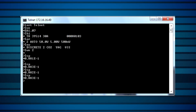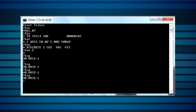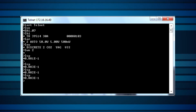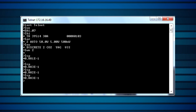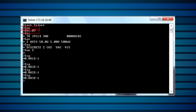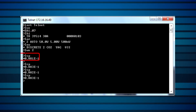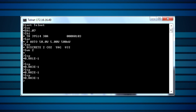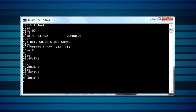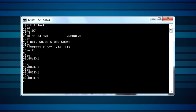Using the Telnet connection on a PC, it'll look something like this. Here you can see some manually sent commands and the responses — for example, a query about the current firmware version and the response, or a command to send the latest power measurement. This may well be the most practical way for you to send commands manually before implementing via your own software.